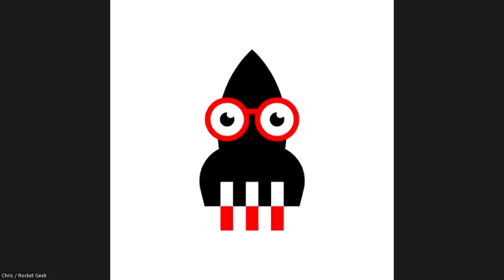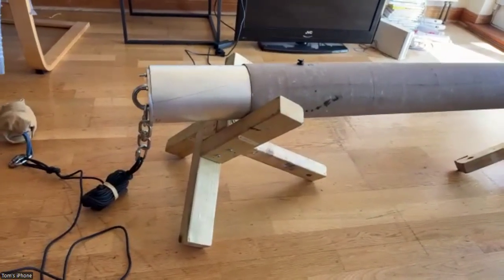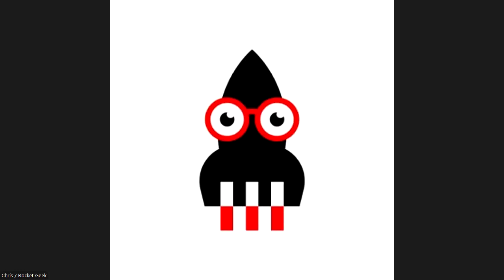I mean, if it's a really big gap, you can coat the inside of that phenolic with a little bit of glue and then sand it to fit. Yeah, we're thinking of either laminating resin or some type of epoxy to get it up. Yeah, you can do that, a couple layers of epoxy and then sand it back to fit.